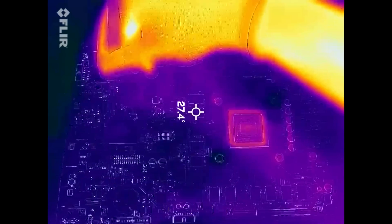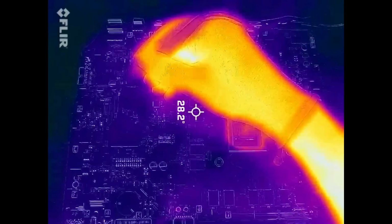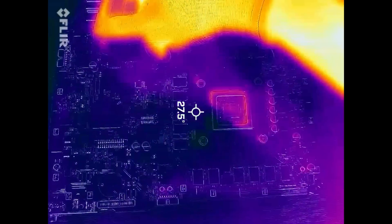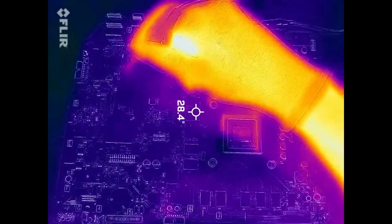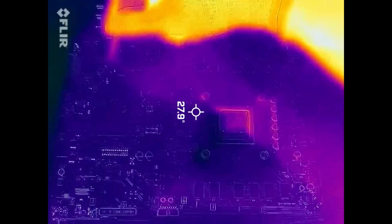Let's put the voltage up a little bit by 1. So the voltage is now at 2, so again, we're going to go on the 3.3 line here. Do we get anything? Exactly the same, 0.036. Okay, let's go up to 3 volts. At 3 volts, we've got 0.86.